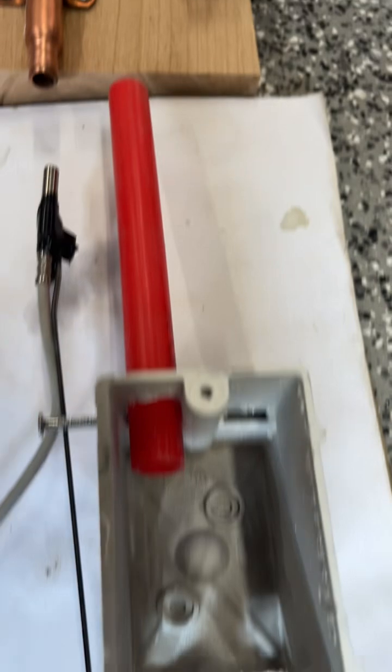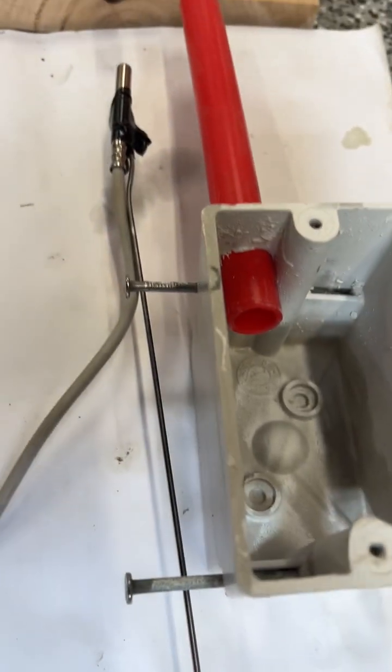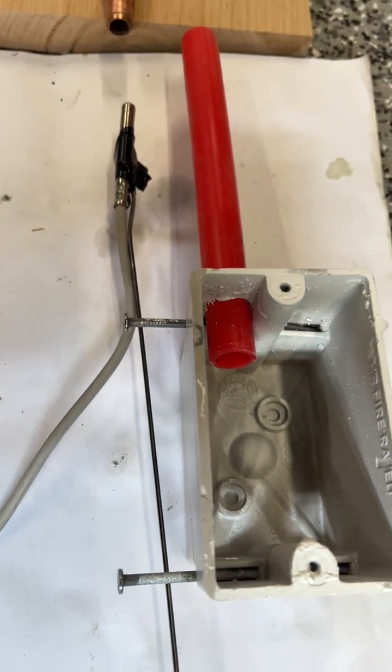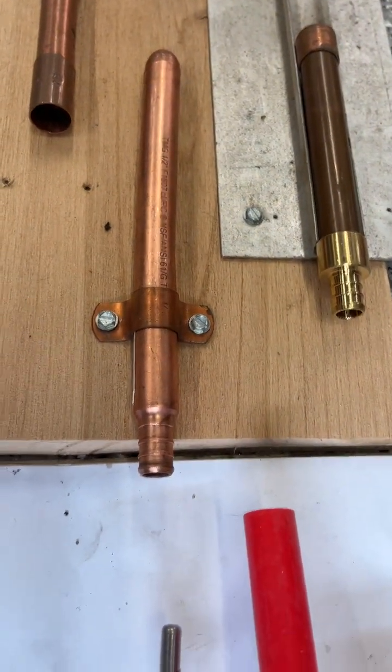Then take PEX and go up to an electrical box, and I drill a 5/8 hole about one inch down. Makes it easier to get the fish tape in there. I just sacrifice the fish tape just by the inside of the fish tape — you don't have to buy the whole winder. Fasten and tape the sensor to it. Then also put a little heat transfer grease into the end of that when you stick it in there.